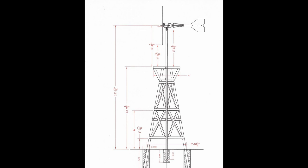Here I have an assembly drawing that I created of the actual wind generator. Some of the dimensions I talked about earlier, but you can also see I cemented the 2x4 treated lumber and the schedule 40 pipe into the ground to support the whole wind generator. The main pipe is a two and a half inch diameter schedule 40 pipe and the rest of the structure is all two by four treated lumber.